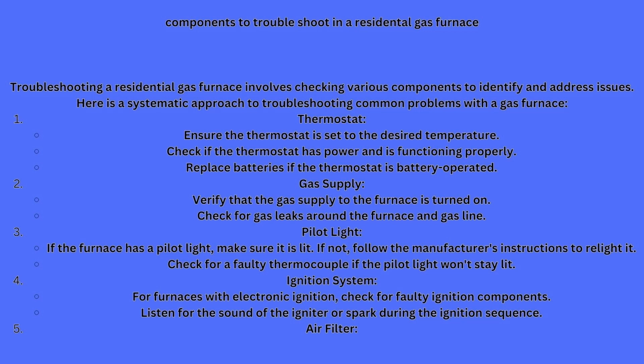Here's a good recommendation. Most gas piping that comes into the home will have a flex tube on it. Under city code, you must have at least 3 to 4 inches of hard pipe going from the gas valve and externally sticking out at least 4 to 6 inches outside of the gas furnace for that flex pipe to connect to. If you ever get to one where it's leaking or you think that you have a leak, if it smells like natural gas, which is like a skunk smell, there should be a shut-off safety valve there on the line that you can physically rotate a ball valve and shut the gas off.